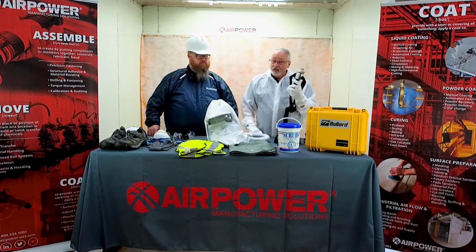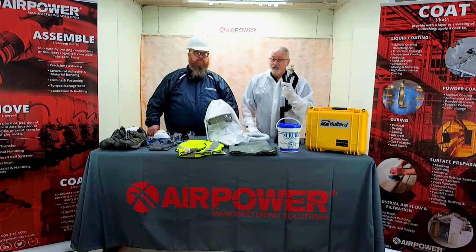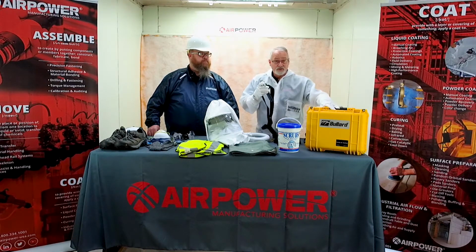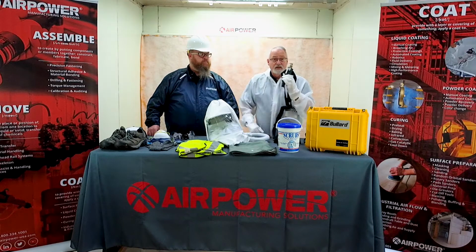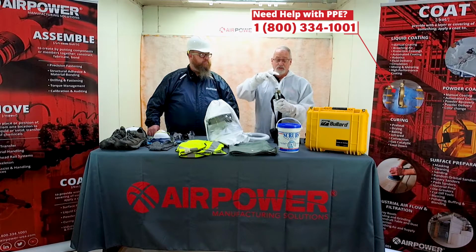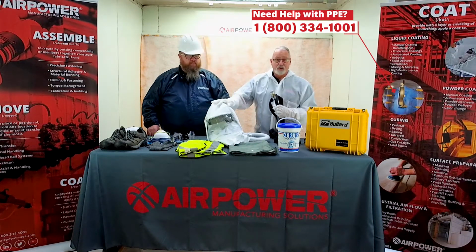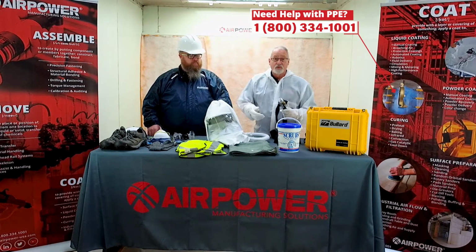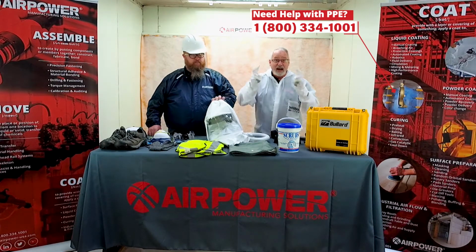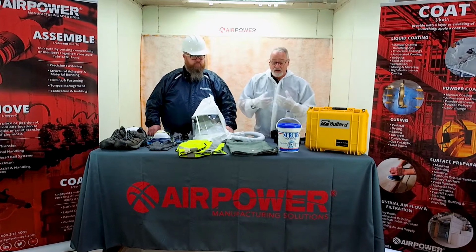One, it's going to be hot in the summertime, and if you're really cold in your environment, we can do that too, but this is called a cool tube. You put that in from your compressed air source, you come through here, it lowers the temperature by 30 degrees. We also have these that are dual purpose, that you can heat with it or cool with it, up to about 30 degrees, so it helps the operator comfort level, and if the operator's comfortable, you get a better quality paint job throughout the day. They stay more viable, they're happier, they're not so tired and fighting their environment, right?